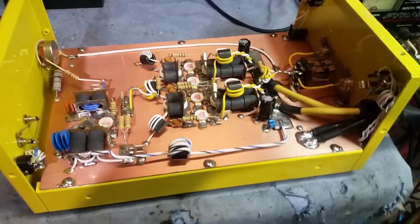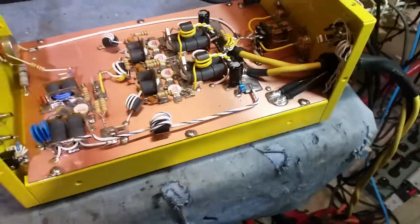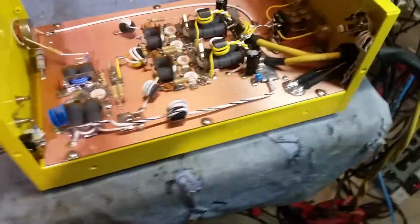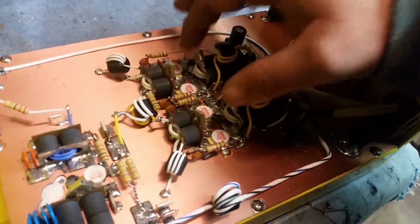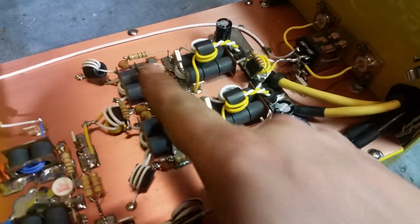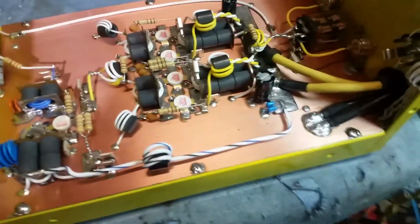You might start it off at 1,000 picofarad 10 years ago or 5 years ago or a year ago, and it may be 800 or 900 picofarad now. It's just a possibility. I've seen it happen a lot, but it just gives it a better chance. That's why we all use metals by default on the output transformer, because these bad boys do get hot. These capacitors right here and the output capacitor are the ones that can get the hottest.